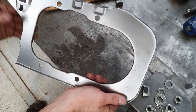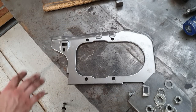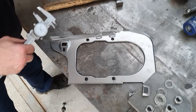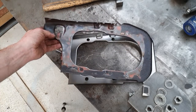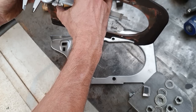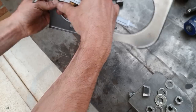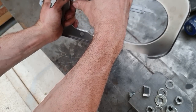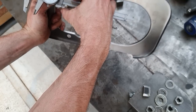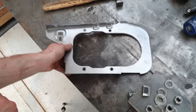Okay, that's a bit better. Right, before I forget, I'll measure those holes and show you, hopefully somewhere near the original one. The original one here, can't remember, 12.7, half inch. On our one, we've now got 12.7, look at that. Generally, it will be within 0.1 to get that spot on. Just a fluke in front of the camera.